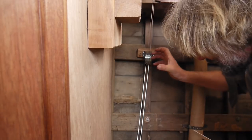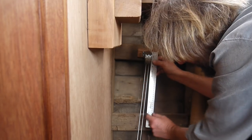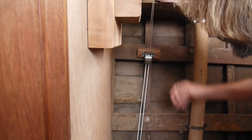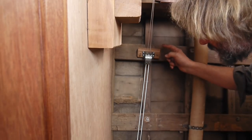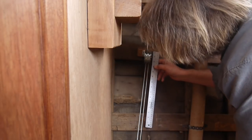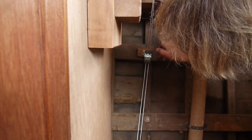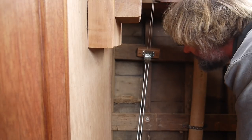Now it's a matter of getting the alignment right. I have a misalignment here - I'd like this to be perfectly parallel with that string. That has to be tipped over as well. It's pretty easy to tell: the block has to swing outward. In other words, extend this screw, shorten this one. Let's get on with that. After a little more tweaking, I can see that I have really great alignment in both directions now. That block is in the right place.